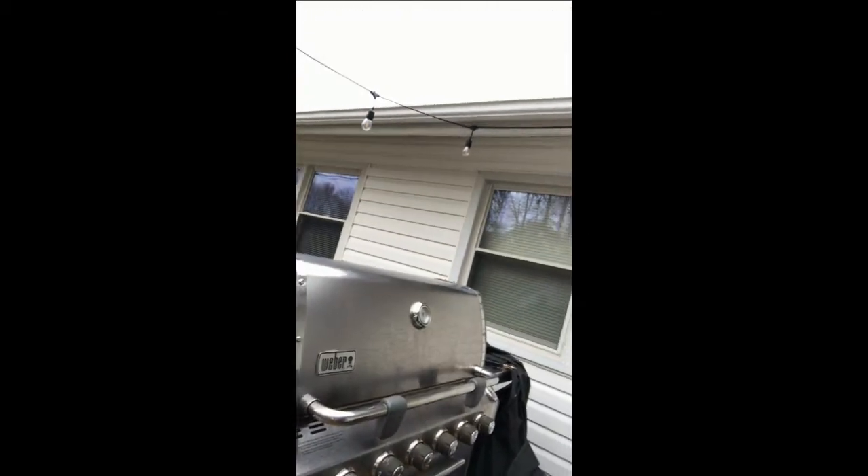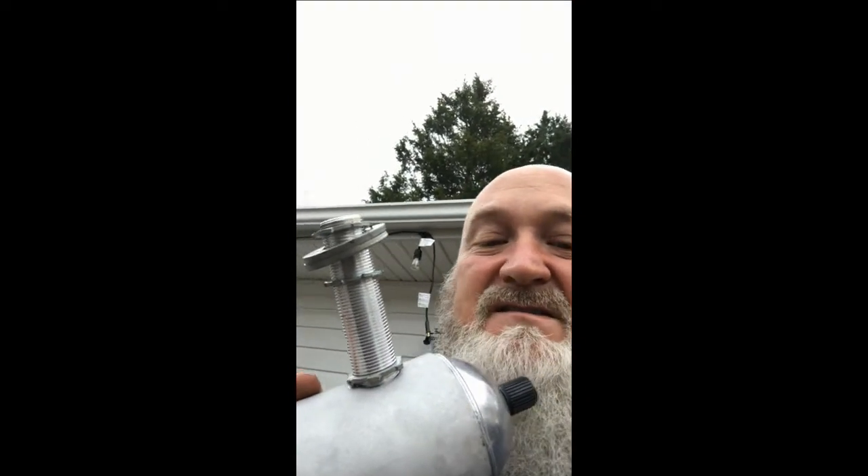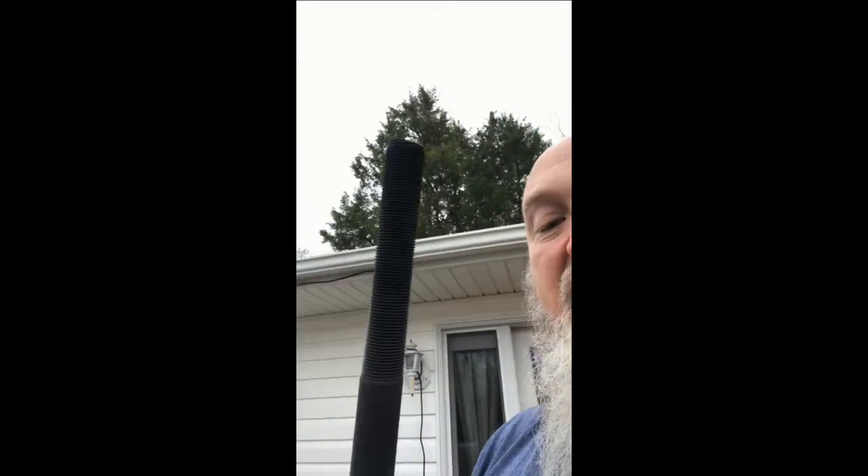So I decided to drill a hole inside the grill and through my shelf. I drilled at the inch-and-a-quarter like they recommend, but the nipple that comes with it is way too short — it's a straight three-quarter inch thread. If you try to mate it with other piping fittings it doesn't work, because they use a tapered thread.